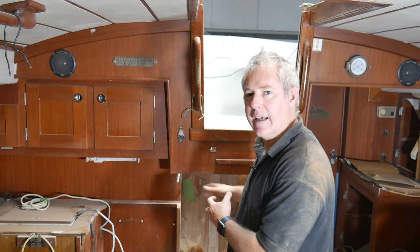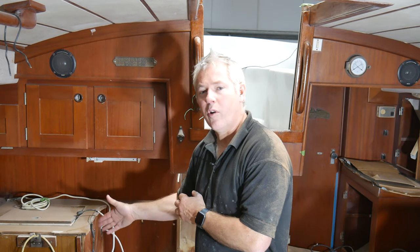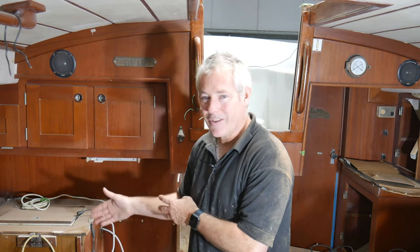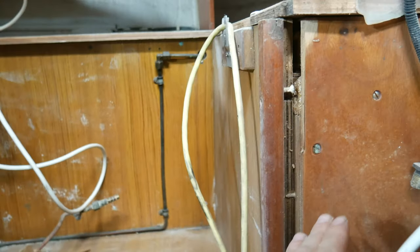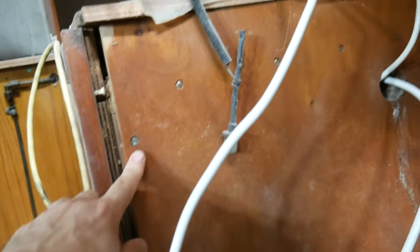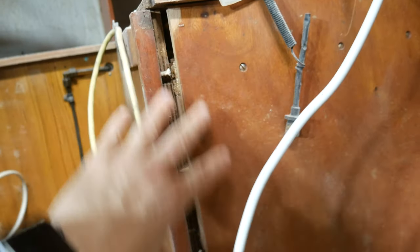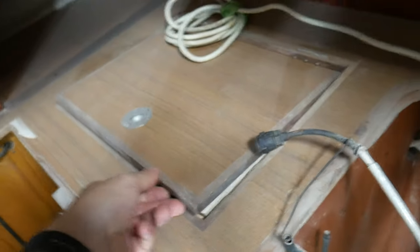Basically, all of this front cabinet was very interlocked so that you had to take one piece out before you could access the fastenings to the next piece. The last dependent piece is wedged in on the side of this cool box, which means you have to destroy the cool box to get to the fasteners to get that last piece out. This piece of timber was so waterlogged and rotten that I was able to literally rip it out past these screws, but to get to the other side I would have had to undo all these fasteners - and then there's all this expandable foam behind here adhered onto this, which means the entire icebox assembly, which is all moulded in, would have been destroyed just to get to this last piece.